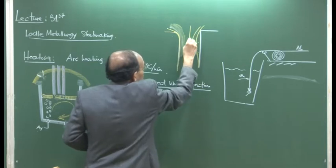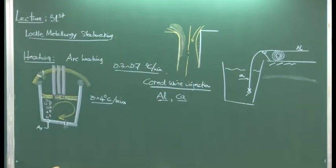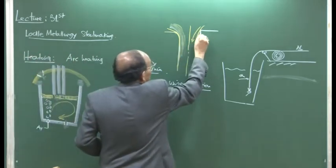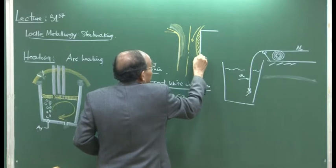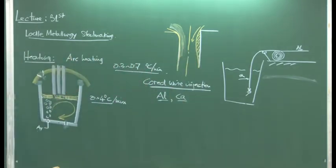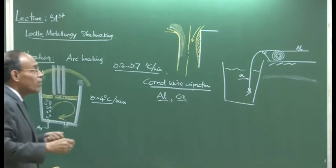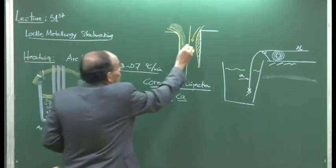When you have this kind of a thing, of course, you have no vena contracta. So, the two sides of the figure are shown, one with a chamfered nozzle geometry, another with a sharp corner, and this is the part where we can see that because it is stagnant, there is not much flow, so there is going to be deposition of inclusions, okay. The inclusions come here, will naturally feel attracted towards the refractory wall having the same kind of composition, and the deposition of inclusions will take place.